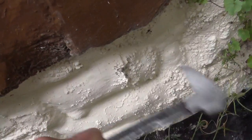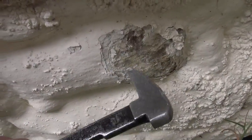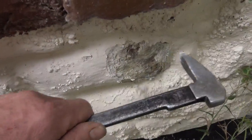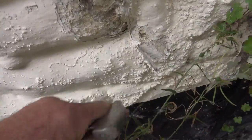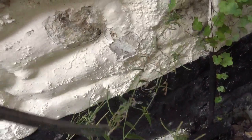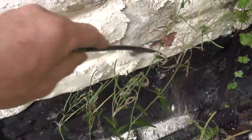You can see everywhere here the same thing — horrible plastic. And if you look underneath all this horrible plastic, you can see beautiful lime wash, hundreds of years of lime wash, and it never came off until some idiot put this blasted plastic on it. Look at that — the plastic comes off in great big sheets, trapping water. And underneath all that plastic — there's your plastic mac that's destroying the building.